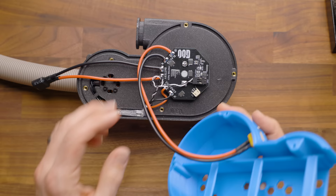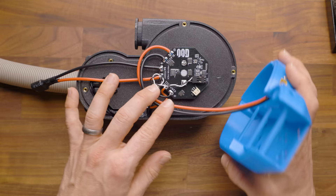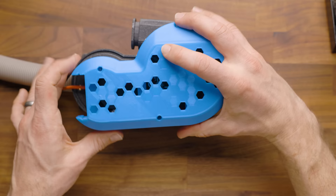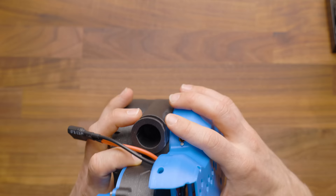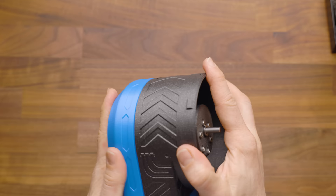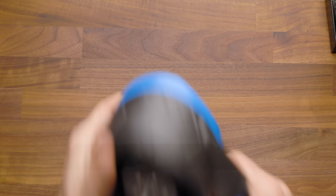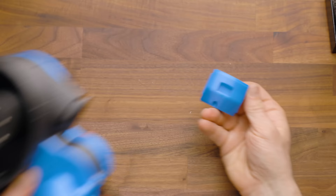Once you've got it, you should be closed up with a solid seam all the way around if there's nothing interfering. I would leave it like that for now because we will get back to the battery door at the end when we're actually ready to test. Next, we're going to put on our auger — the auger takes two 20 millimeter screws. You're going to thread them in here and here. Before you do that, look down the center of this hole and make sure that it looks clear. You will see little metal bits — we have pre-installed the square nuts. There's a chance that they might shift, but we made this hole nice and tight so they should stay.